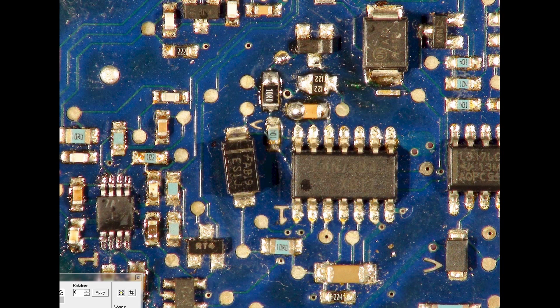Here's the back side image of the Sandbox 10 power board. This is the power supply management circuitry that generates the pulses and manages the drive to the FETs. You've got your FAN7384 half-bridge gate driver IC, LM317, what I think is a wide-bandwidth op-amp used as a comparator in this application, and an LM5021 current-mode power supply management chip. This board has been repaired before and is a working board.